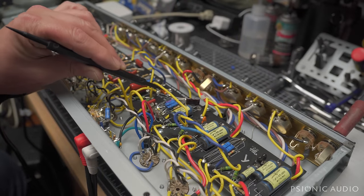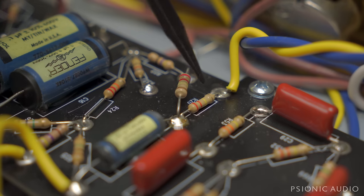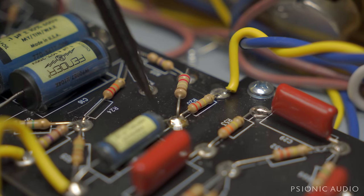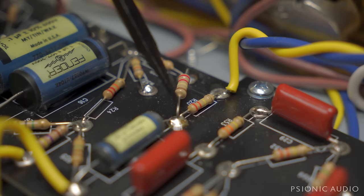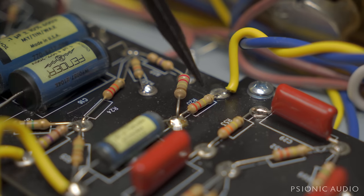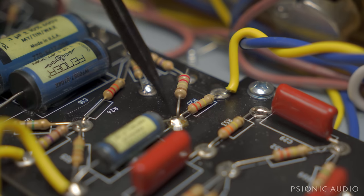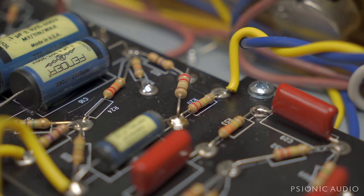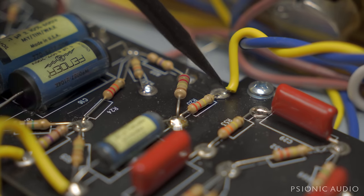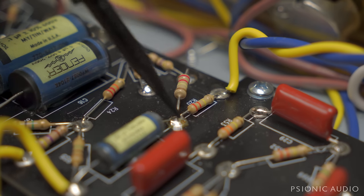The big change beyond all that, which reduced a lot of the white noise and made the amp respond like an actual Deluxe Reverb: they have this 220k resistor between the output of the previous stage and the input cap on the phase inverter. The old AB763 had a 220k here but also another 220k coming from the normal channel, forming a set of mix resistors that lowers the gain into the phase inverter. They did not have that mix resistor here — it's crucial. Even if you're not using the second channel you've got to keep the gain the same as it would be in a Deluxe Reverb. So I have added a 220k going to ground, and this has lowered the gain back to correct Deluxe Reverb levels.